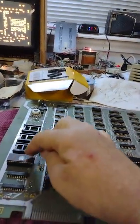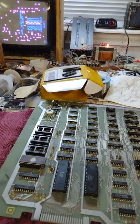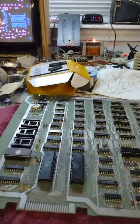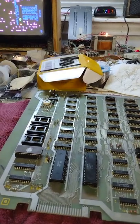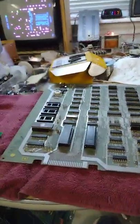Assuming that they programmed this chip with all the ROM codes in the proper sequential order, it should plug right into my board and I shouldn't have to program an EEPROM — I should be able to just plug that one in. So let me get started on this and I'll get back.